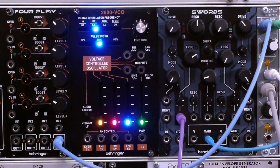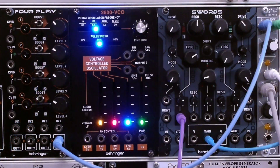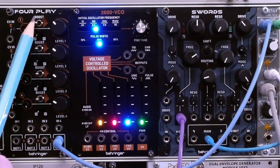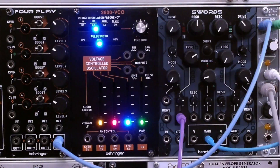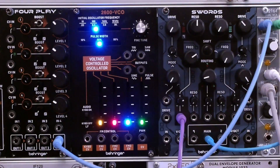Let's take a quick look at the audio inputs and outputs as well as the level controls, including the CV inputs, switches, and knobs. You have your audio in down here, all four of them, and your audio out. You have four CV inputs and an attenuator that will attenuate the signal coming through the CV input. You have a level control which is a manual level of the VCA gain. You also have a switch that will boost the gain of the VCA by plus 6 dB. Finally, the response of the VCA is shaped by the curve knob, which can vary the VCA response from exponential in the fully counterclockwise position to linear in the fully clockwise position.